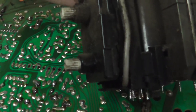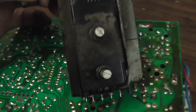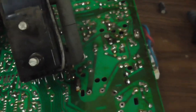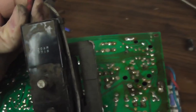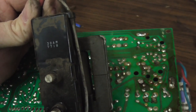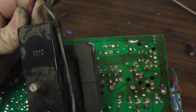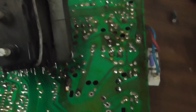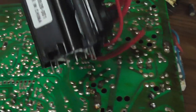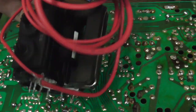So, it probably would have worked that way for a while, but the problem is, these white knob ones, they'll drift. So you can get it dialed in, get it looking good. Come back in a half hour, it might be brighter. Come back in another half hour, it may look good, maybe too dark. Come back in another half an hour, the focus is all off. So I just swap them, I just change them. This is what it's supposed to look like. It's a new one.